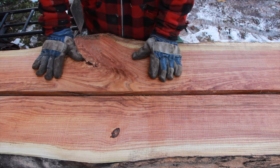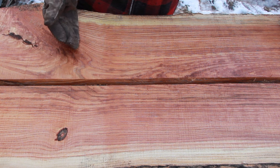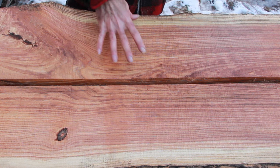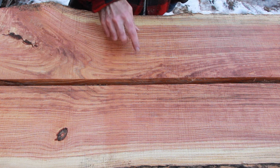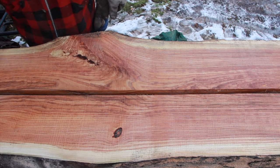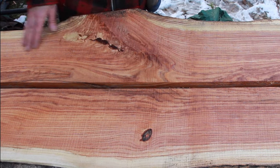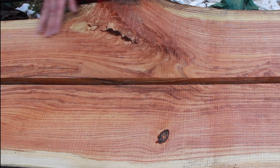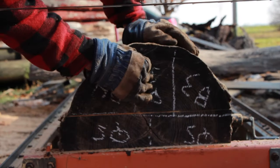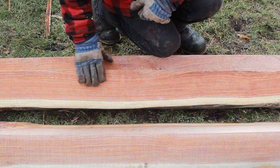Here we have that big center of the log — cut it in half. You can see we've got what would make some nice guitar backs, acoustic guitar, maybe even classical guitar, just wide enough. Keep in mind that about an inch and a half further down will be the true 90-degree quarter sawn. Further up the log we certainly have some guitar sides here, and maybe even electric guitar veneers — we'll have to see what that looks like when it dries. Here's a quarter sawn section from one of those top and bottom cut-offs — really like what I'm seeing there, perfect width for guitar sides.